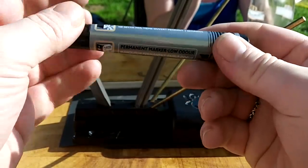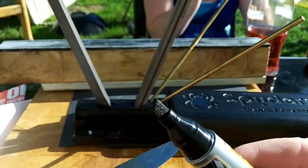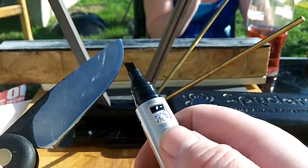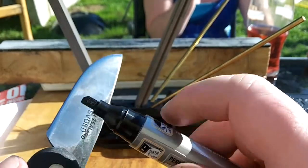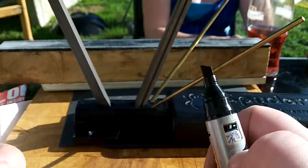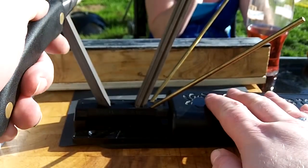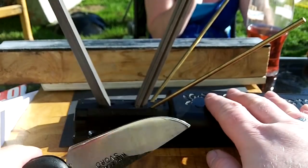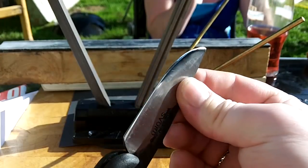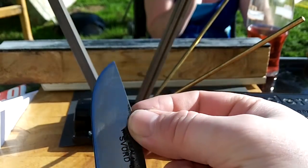If you want to see if you're actually hitting the edge where you want, get a big thick marker pen and paint your edge — mark along the two sides or slice into the tip. Once you stroke it down the stones, the abrasion should take off the black marker where the stone meets the steel, showing you're hitting the very apex of the edge and sharpening all the way out to the point. You can also see any flat spots — it's a very good indicator you're going on the right track.